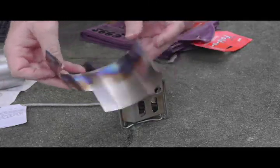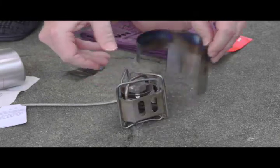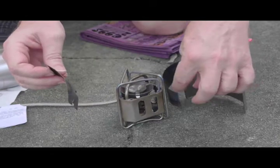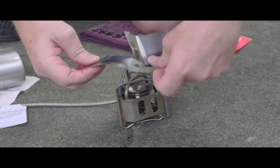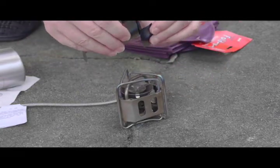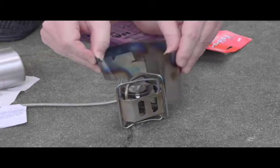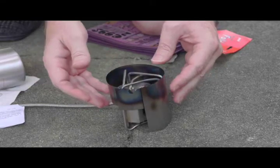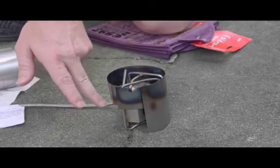This particular piece made specifically for the Primus MFS EX stove doesn't fit this stove because it's too short, so I made a modification with a small piece of leftover foil. I put a little fold at the point so it will interlock with this fold-over piece, and there are small tabs that engage this portion here, which is also folded-over titanium. When put together, it lengthens the circumference of the available option so it will fit around the stove, and this cutout will clear the gas line. These little interlocking tabs simply lock in place, and there it is — a very compact chimney with airflow coming in from the bottom.